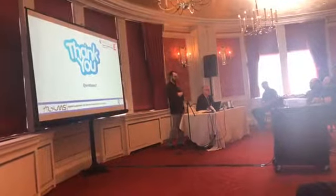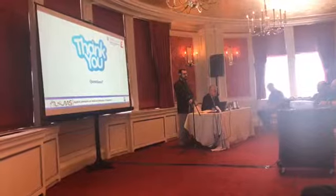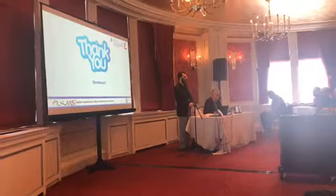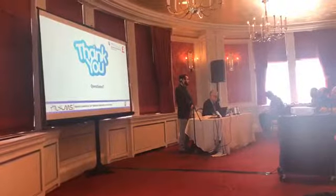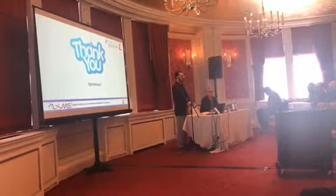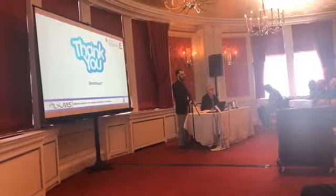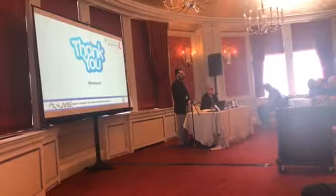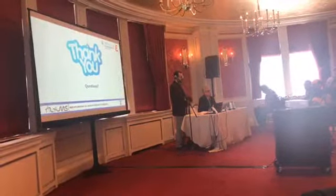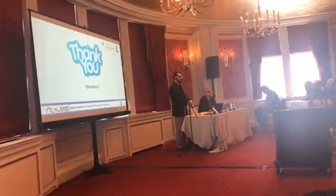Thank you. That's a very good question that we are trying to address now in the research. Constructability-wise, it is easier to build than BRB. BRB involves a lot of complications to build, especially the debonding between the core and the mortar fill around it. So that's one issue. Cost-wise, of course, SMA is still quite an expensive material. It's getting cheaper every day, but still it's expensive compared to steel and concrete.